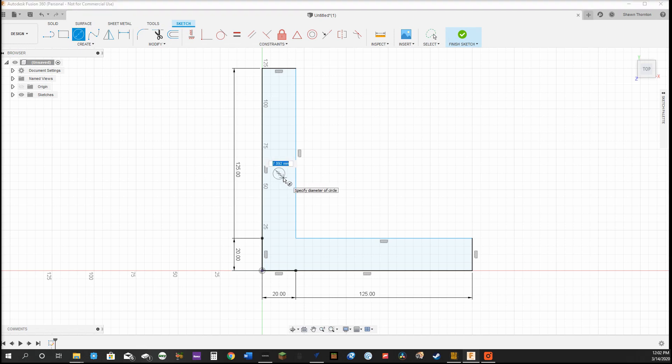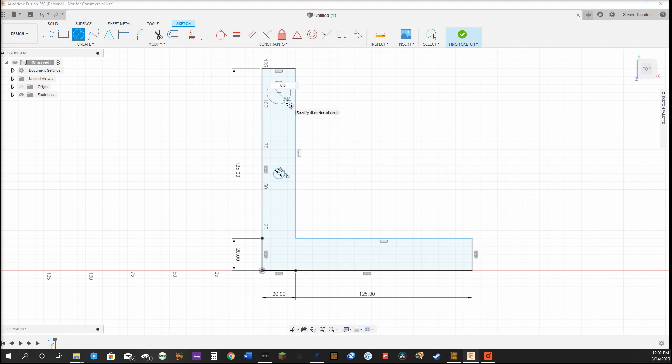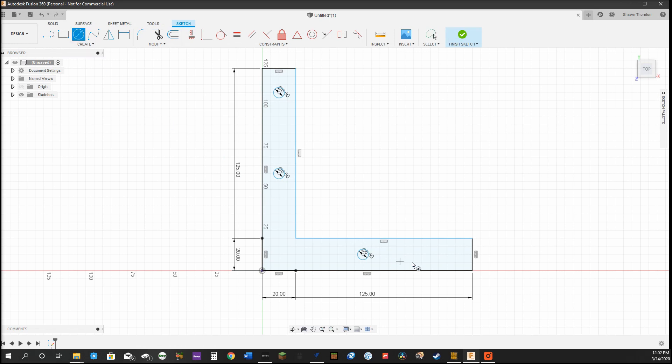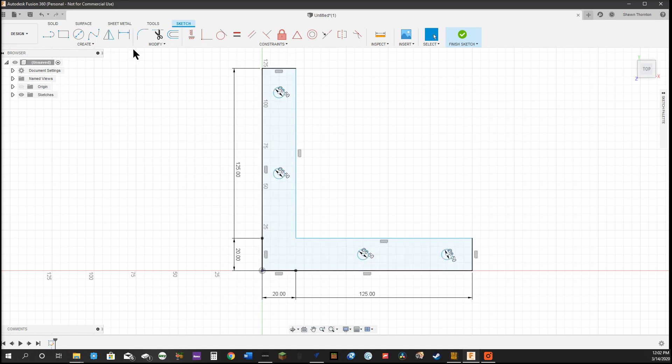So we're going to add our bolt holes — or screw holes — and we're going to countersink them. We're going to put two separate circles: one for the outer diameter of the head, and one for the inner diameter which is the outer diameter of the actual thread. In this case we're going to use a 6.5 millimeter radius for your screw heads and then 3.25 millimeters for your thread. The first time I did this I put them at 50 and 100, forgetting that we're starting 10 millimeters over because I have to center them — so don't do that like I did.